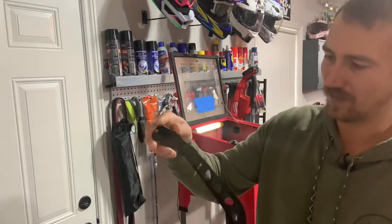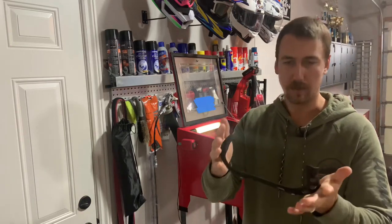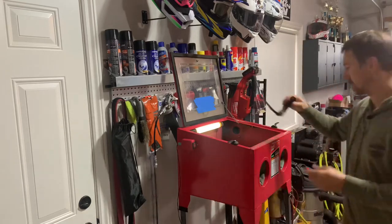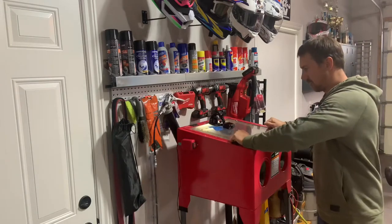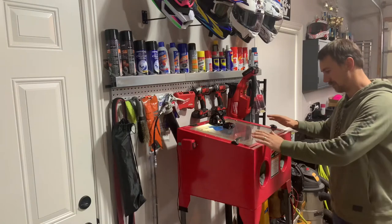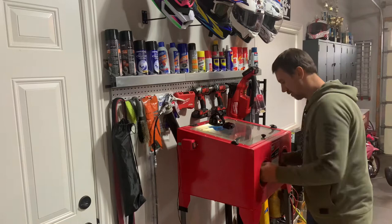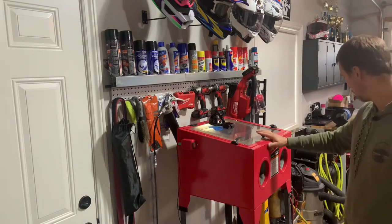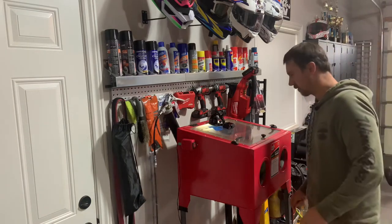We have to sandblast and get some of that rust off there, then get it painted up again with some nice ceramic paint to make it last and look a little better. Set that in the cabinet and secure the lid. In the past I had to wear a mask just because of all the dust that would come up and you'd be breathing that stuff in. I'm expecting that not to be required now with the vacuum sucking all that out. Alright, let's give it a try.